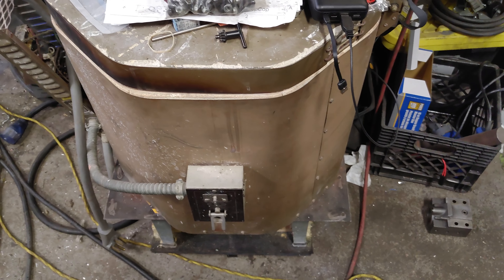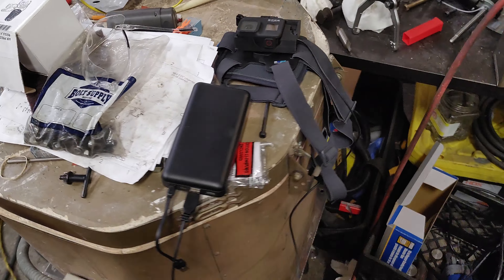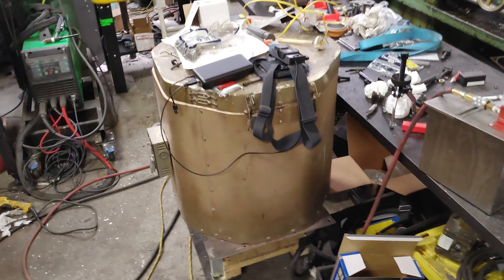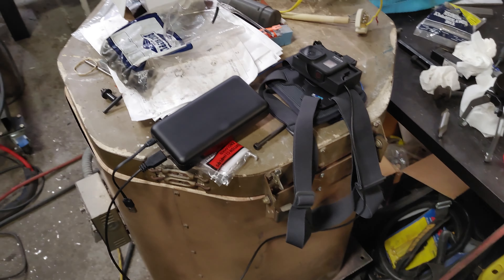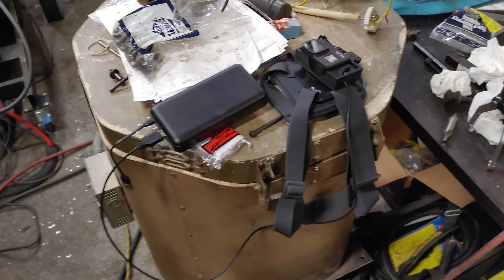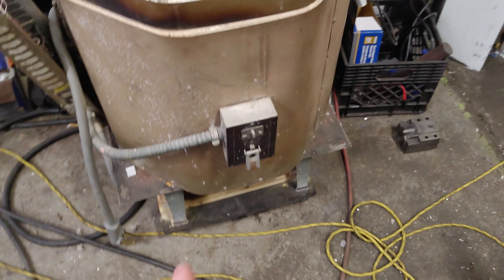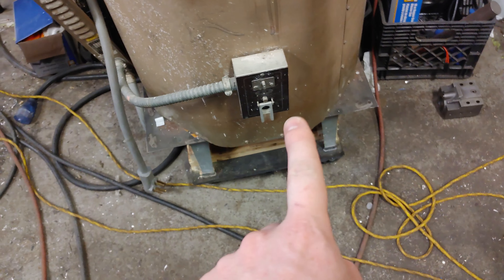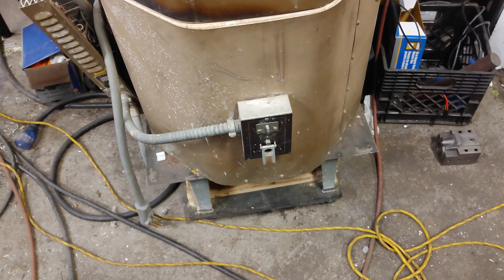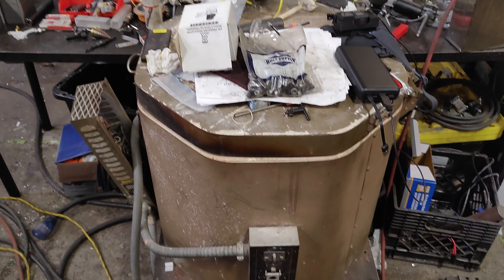My workbench, which is an absolute mess. This is my kiln, which I'm going to use to heat treat things. I'm also going to build my own foundry to melt aluminium, which is what this kiln is going to be used for eventually. Aluminium loses a lot of its properties when cast, so you need to quench it and artificially age it to get those properties back. I just need to build a control for this — the old systems worked on a cone of clay that bends at a certain temperature and knocks the switch off, but I've got a $50 SCR and temperature regulator.